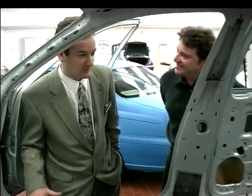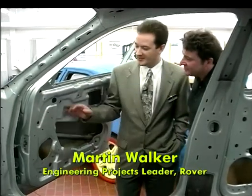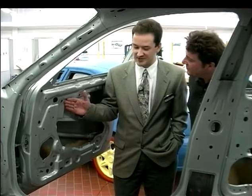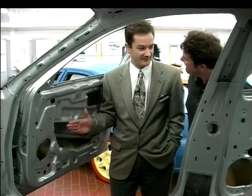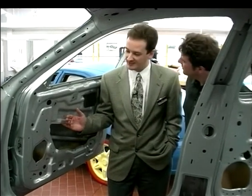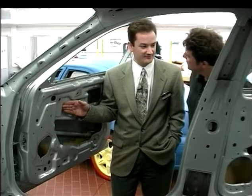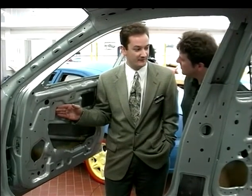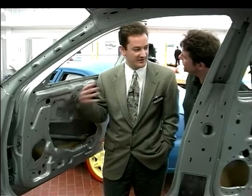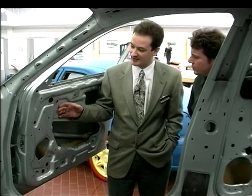We've used them in one or two areas across the vehicle, but there's a prime example here. A tailor-welded blank — the blank refers to the material in its flat state before any pressing operation has taken place. What we can do is actually weld together panels of two different thicknesses before starting to press that panel. So we're doing the assembly operation before the pressing operation.